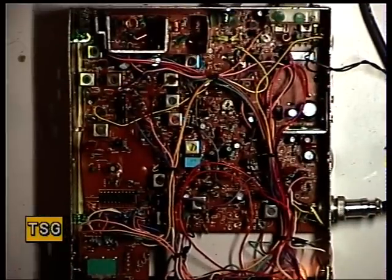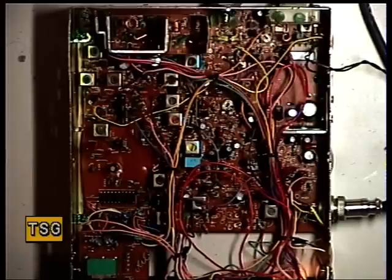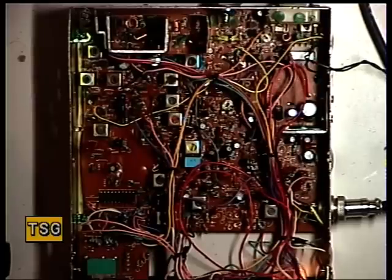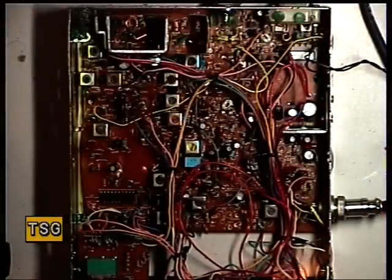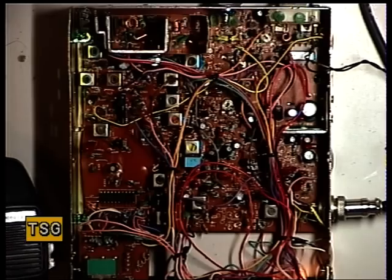It sent me on a merry song and dance this evening. Running through it before doing a video with you, I've come to the conclusion that it got the wrong transistor in the output - there's no transmit output. It had some kind of V-MOSFET device in where there should be a 2SC2078, so that's what it's got in now. The trouble is it had burnt out several resistors in the circuit, so I've replaced those. One of them unfortunately isn't shown on the printed circuit board as to what resistor number it is and I can't find it anywhere on the circuit diagram. What I've done is look at service manuals of other sets and similar position resistors on similar circuits, and I've come up with an educated guess of replacing it with 10 ohms - and it seems to work now.